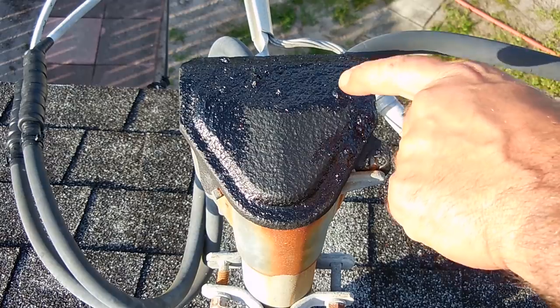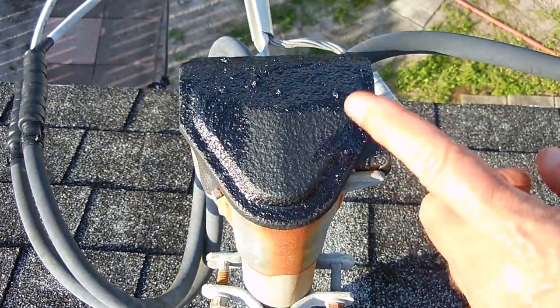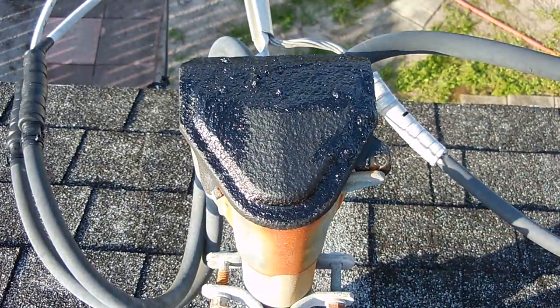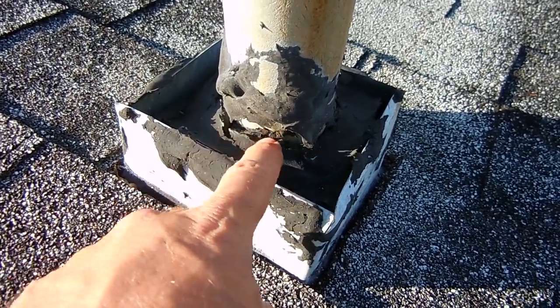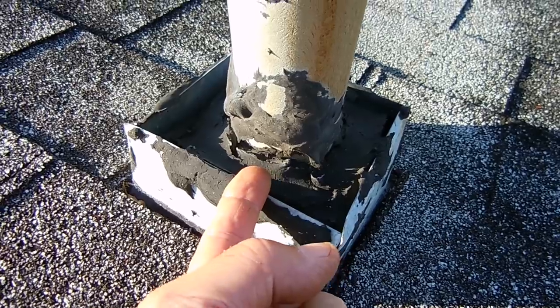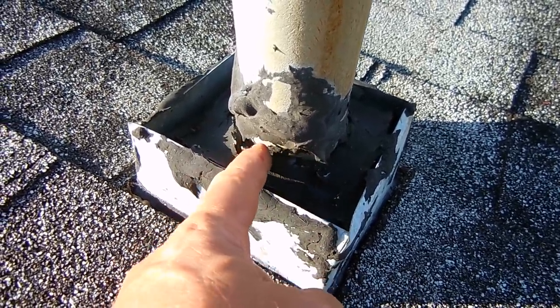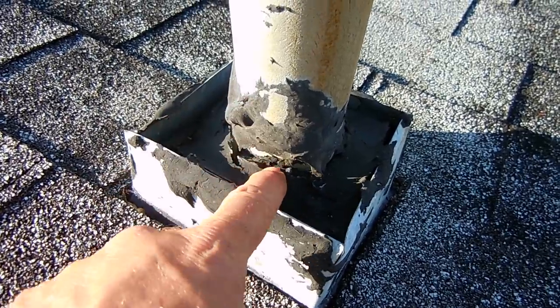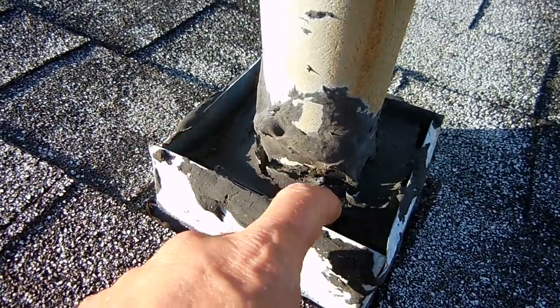The rivets were all filled up with wet and dry roof cement, so this will no longer leak. There's one more issue and it's straight down where it connects to the roof. Right over here you can see the tar is all separated. More than likely, a long time ago when they put the new service in, they pushed this mast upward, breaking the seal. So water is finding its way between the pipe and this tar in this area as well as the flashing and this tarred area.